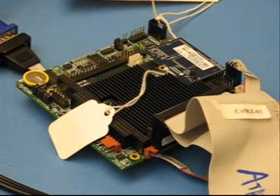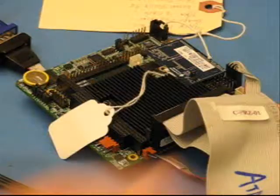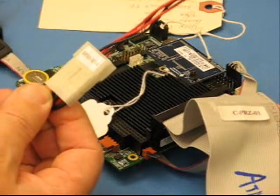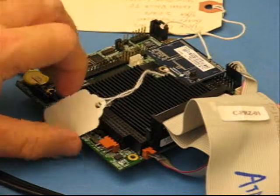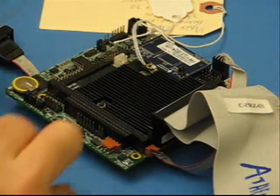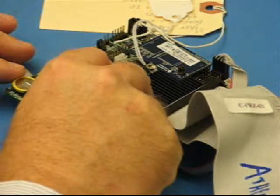Then we're lining up power, regular standard 5 volts. Athena only requires 5 volts, so here's the standard power, and here is the connector for power, which is 6981099. This is Rev A, and I'll be hooking up the power supply. Make sure everything looks good before I hook up. Make sure I'm grounded, because I'm bringing power onto this board now.